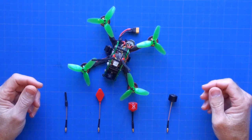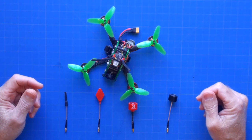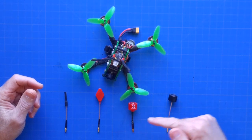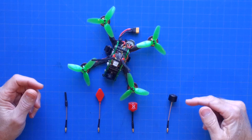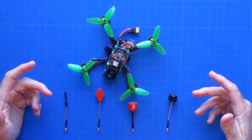So what can we learn from this antenna comparison? First, I think we've clearly demonstrated that if we're going to be doing proximity flying — relatively low altitude, and or through, around, or near obstacles, structures, trees, etc. — it's probably a good idea to use a circularly polarized antenna if at all possible, to mitigate the effects of multipath interference and get a better, clearer FPV video.